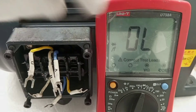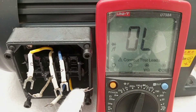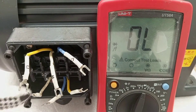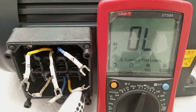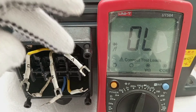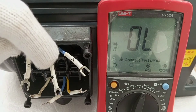By the color code used for these wires, I can easily identify the beginning and the end of a particular winding. You can see yellow, white, and blue at the top. And then at the bottom, you see white, blue, and yellow. So what it simply means is that if this is the beginning of a particular winding, that winding ends here. If this is the beginning of another winding, it ends here. And if this white is the end of a particular winding, then it started from here.